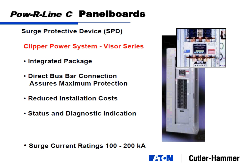So I always say, when you're designing, any service entrance equipment, whether it's a switchboard or panel board, needs to have, highly recommended, some type of surge protective device. Then you look at the critical nature of what loads are in your facility. If I'm a school, I would say there's going to be a lot of computers, or a hospital, or anything along those lines. You should add multiple layers downstream. TVSS or SPD at the main service entrance, a couple more at some critical distribution panel boards, and then you go right on down to your lighting and receptacle panel and pick out the ones that feed the critical loads and put that third level in, even one down.